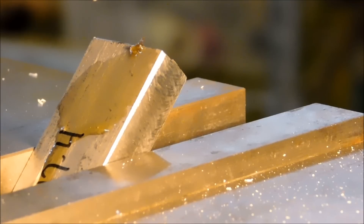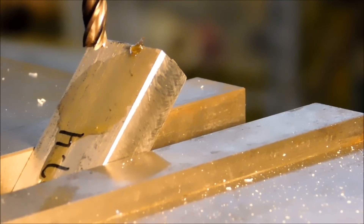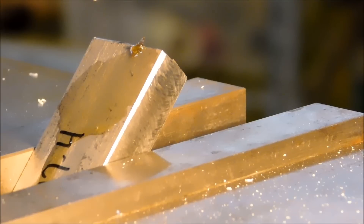Sequentially, I'm going to come up with the table at about 10 or 15 thousandths at a time, and I'm going to come back down with the end mill, and I'm going to continue that operation until I have a full footprint. Now if you're allowed to, you can also sweep in from the side to your location, but it's not going to give you a true track — when you look down on top of it, it's going to be more of a doghouse shape. So if you need a hole, follow this method here.